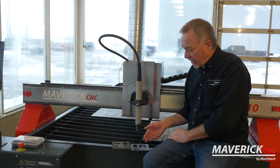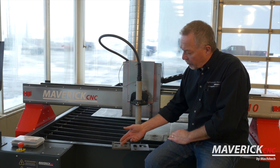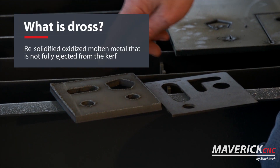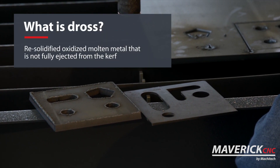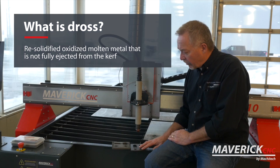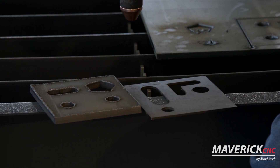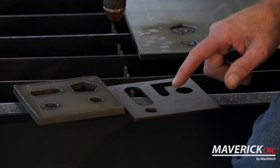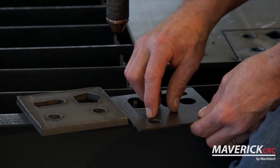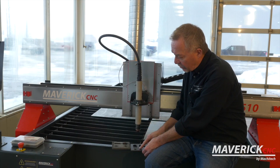Here are a couple of cuts — they are different materials, but I'll use them as an example. This sample on this side was cut and you can see there's some pretty heavy dross on the back. Some people with plasma cutters have been cutting drossy parts like that for 10 years and think that's just the way plasma cuts. If you look at this other sample, this also is an untouched cut, but it was cut correctly at the correct speed, at the correct amperage.